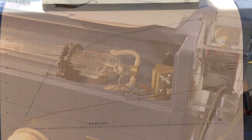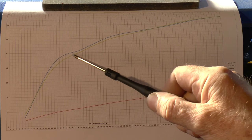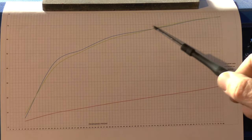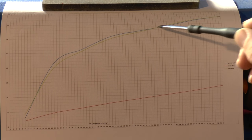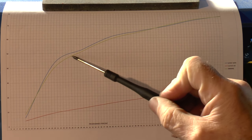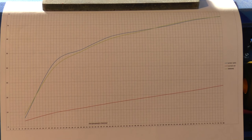Here's the revised calibration chart. The green line is the new line — it's a little bit low at the bottom end but nothing terrible, and once it gets up towards the top it's virtually exactly the same, so it's certainly still delivering as a 70-watt tube with no real drop-off in the power characteristic. I would expect as it gets towards the end of its life that the green line will start tailing off, but at the moment there's no sign of that. Over the next few months we'll just see what happens.